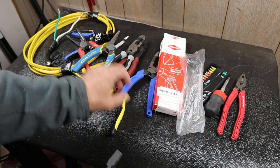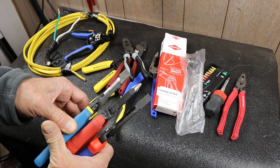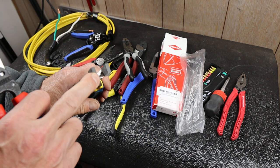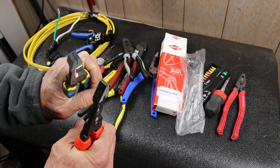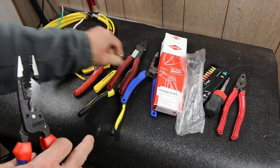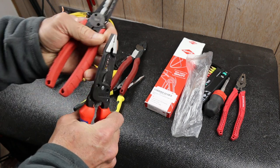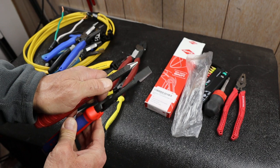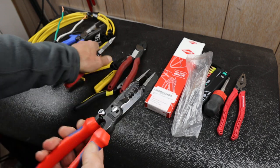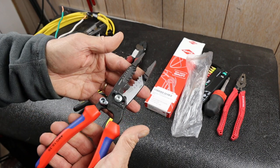They do make a narrower one that has more of the smaller tips, similar to my Milwaukee. You can see the different tip designs here. I really like this grabbing surface — it's kind of why I went with this one. This one's a lot beefier; the Milwaukee is a lot finer. I've found the thicker one is too thick for a lot of things, and all three of my Kleins are pretty thick. This Knipex is narrower, similar to the Milwaukee, but it actually is narrower even though it's a wider jaw. It's a trade-off — sometimes I find the Milwaukee just isn't enough for grabbing bigger parts.